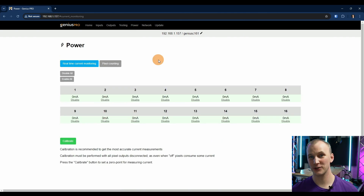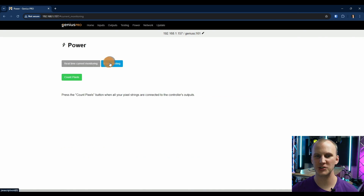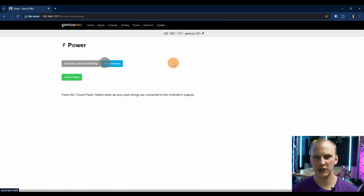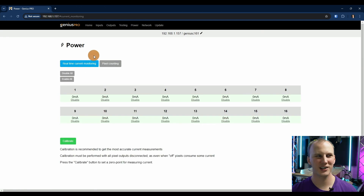This is one place that's really cool: they do real-time current monitoring and pixel counting. You can actually see how much power your pixels are drawing and use that info to fully load your fuses. They also have e-fuses built in — I think they were the first controller brand to do that — which means no more physical fuses. They're electronic; if they trip, you can untrip them in the interface, or they'll automatically untrip on reboot. You can also count your pixels by plugging them in and hitting a button.